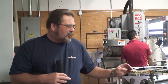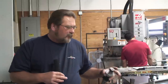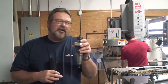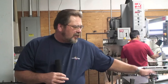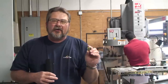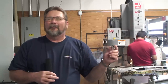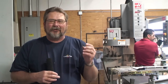The other piece of technology we're using is called flow drilling. We take a carbide bit — and we can only do this because we're cutting on the A-axis in the CNC mill — and pre-program it to spin on top of the tube until it gets the tube red hot, then slowly plunge it down into the tube. What you get is a perfectly formed hole in a structural tube that eliminates stress areas. Once filled with a screw, it's as strong as the tube ever was. These are just two of the many advances we've made in building our Carbon Cub over the old Super Cub.